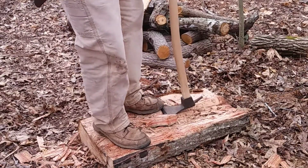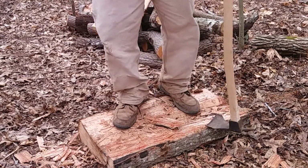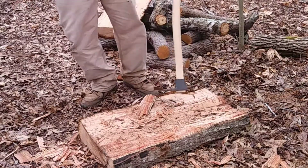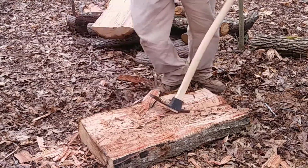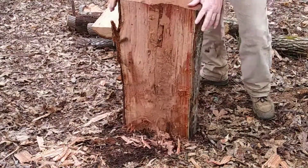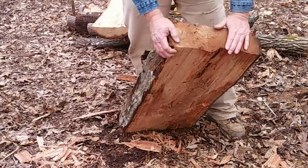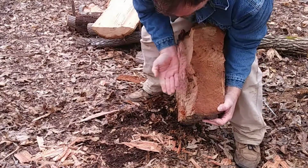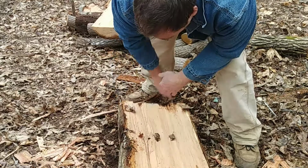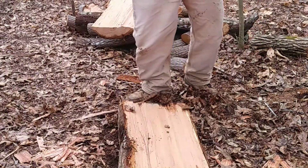Saw, it's been a little more aggressive right there because there's a thick spot here on the edge of the log or the plank that keeps me from getting to this valley that's right here. Now there's another low spot here, so what I'll actually have to do is get the axe and draw a line with a pencil across this, or pop a straight line, either one. And I will take the axe and chop in and then pull off the pieces, and then I will work on getting it all nice and flat, and I'll show you guys all the steps with axe and adze. This is going to be a little table when it's done.